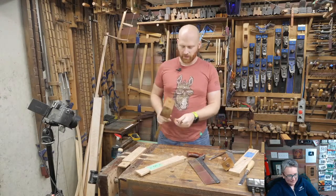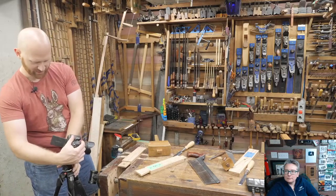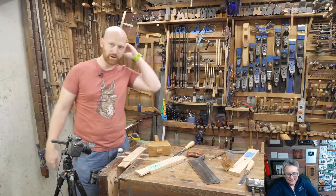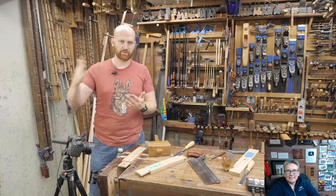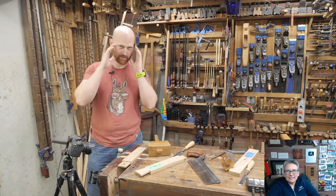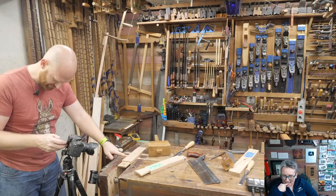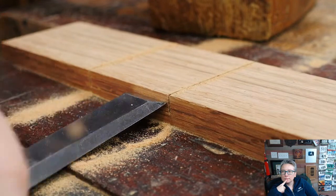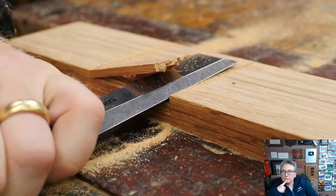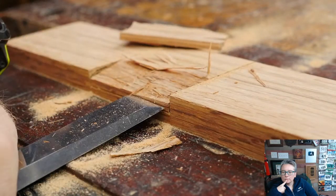Joinery mallet, and I'm going to grab a one-inch chisel. On this one, I'm going to get the camera a little closer. So what we're going to do is chisel this down. My bottom line is right there — I don't want to go right into the line yet. I'm actually going to come up about halfway and aim up — I want it to blow out the top. Do the same thing here, about halfway down, aim up. And then I'm going to come about halfway down again. I'll let the chisel rest on the back — that gives me a really nice angle and makes it easy to control. I don't want it to hit the backside; I want to come out before we get to the back of the board.